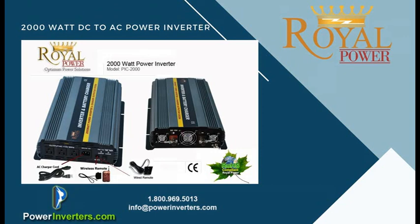Today we're taking a closer look at the 2,000 watt inverter charger with built-in transfer switch. People are primarily using these for their sump pumps in their basement. When sizing your inverter, if your pump is rated at about a quarter horsepower to a third, this is probably going to be the right inverter for you. If you have a dual pump system or if your pump is rated at about a half horsepower or larger, you're going to want to go with a 3,000 watt unit or larger.